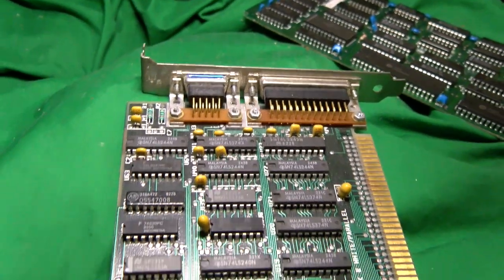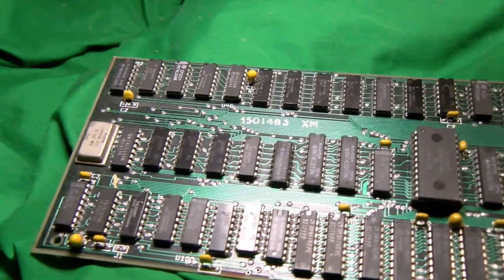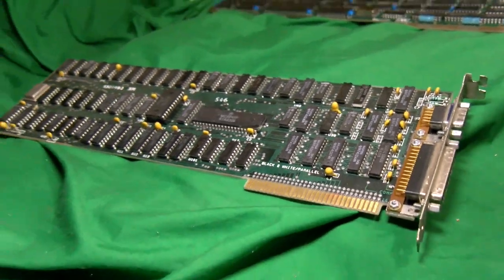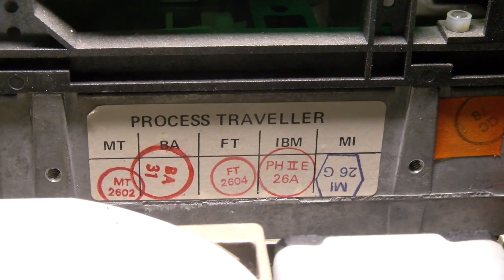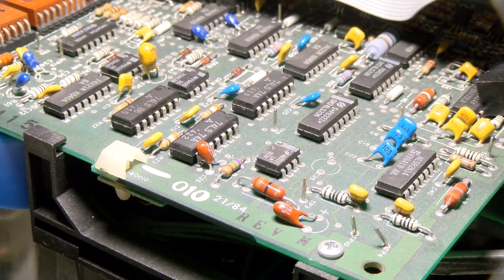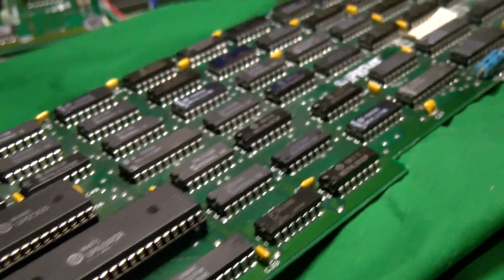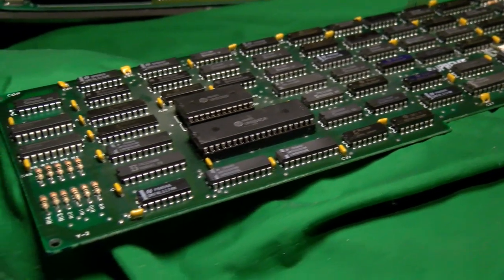The system actually came with this MDA card, which is purely monochrome text, and like most of the original hardware, either an IBM part or a one-to-one copy of one. To be honest, the date codes on everything that I suspect as much are quite close together, and I wonder if maybe somebody gutted a 5150 to keep this machine going, or, to be honest, whether Dow products were dealing in e-waste and just cobbling these together and reusing parts. It wouldn't actually surprise me. These clones have been known to relabel ICs and stuff, so I wouldn't be surprised they were sticking used floppy drives and video cards in.